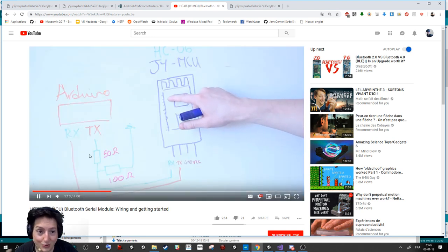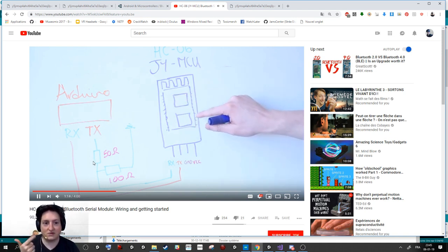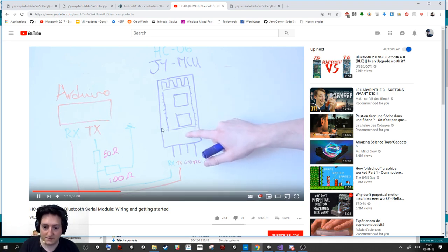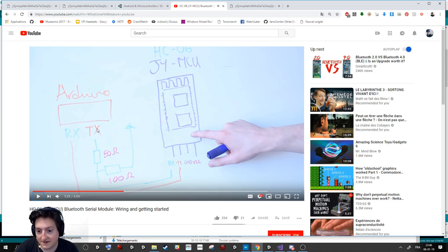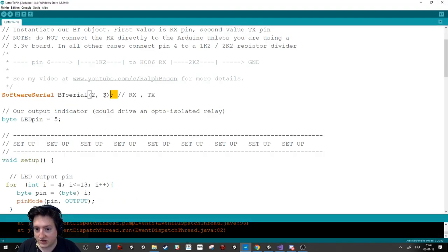Basically, my problem with the video he did is this. He did a small tutorial, but he's not explaining a lot about electricity, about Arduino, about the terminal, about the application. And so, for example, here you have two mistakes, RTX and TX. If you do it like this, your Arduino will never compile anymore, because when you compile, it needs RX and TX. And so you need to do a redirection where you say RX and TX will take this pin, else it will not work.